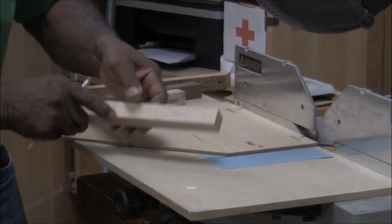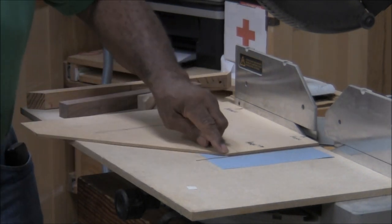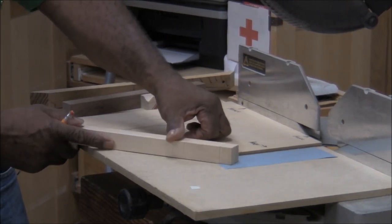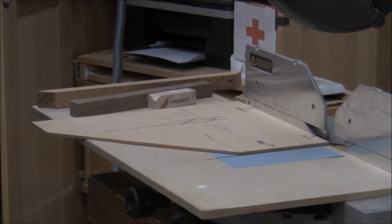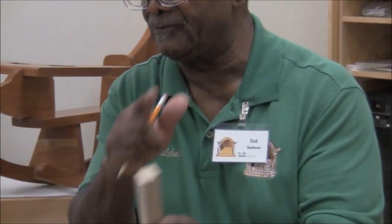All right. When I slide this up to this mark in this arrow, I'd have to do each side like that exactly. I mean, I only have to do it twice, once this way and once that way. All right, but I do it at different times because once I cut one, I have to glue it on. When it dries, I have to turn it the other way and do the other cut. And then clamp it. And I'm going to show you how I clamp it so that the sides don't slide all over.